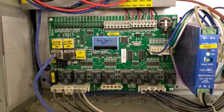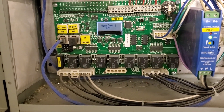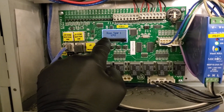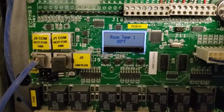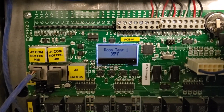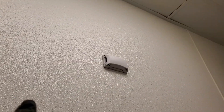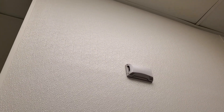For now, the solution is that we have to make sure that the kitchen staff understands they have to manually turn the hoods on. If they don't, they'll auto-turn on for safety, but theoretically, with that temp sensor being bad, they could auto-power off too. I'm starting to wonder if it's just a bad sensor placement, because the temperature is dropping as I'm sitting here. I found it — it's over here. This is a really bad location because we have a supply grill right here, and it's just blowing on it. That's why the room temp was so high.